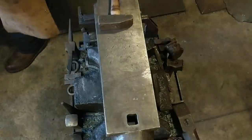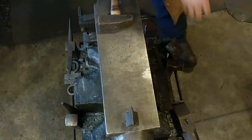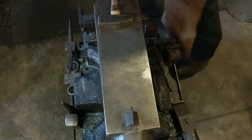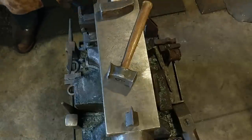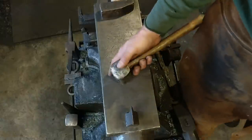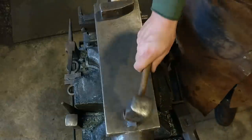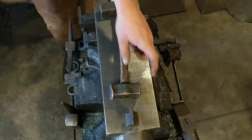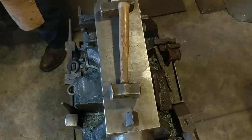Stick it back in the fire — a lot deeper this time. I'm going to get my cutter up there. I'll use my soft base hammer. I haven't made a new one yet, and I haven't dressed out these chips because this is as soft as can be — it's practically lead. I use it for operations where I've got to hit a cutting end of something, so it cuts the hammer, not the actual tool.